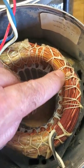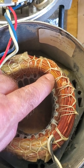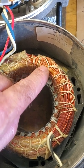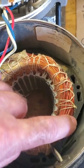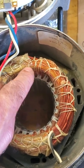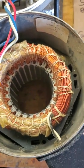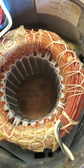On the inside is the start winding — always towards the rotor — and it has smaller gauge wire, because the start winding is only in the circuit for just a brief instant as the motor starts up. Start windings get hot really fast. Then when the motor's running, the other capacitor kicks in and feeds just a little bit of current through the winding, so the start winding can be made with smaller diameter wire. When you're buying a motor at a yard sale, the start winding is almost always the one that's black and burned out. But look at this motor — this is a good capacitor start, capacitor run motor, and the windings are in good shape.